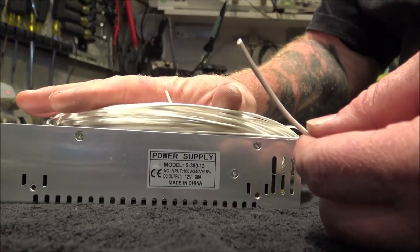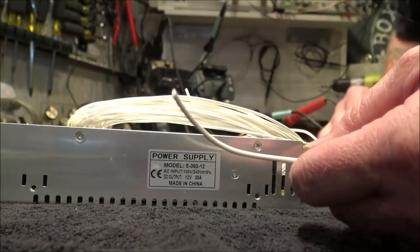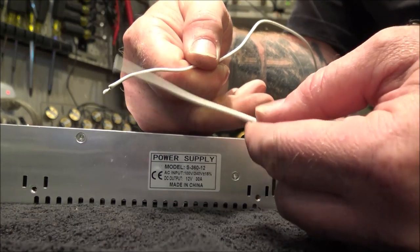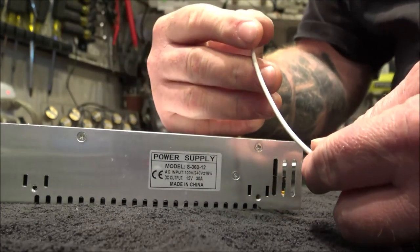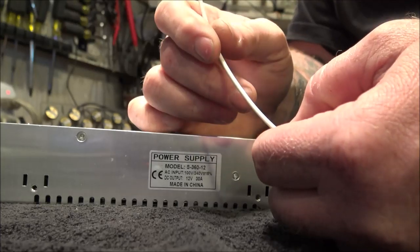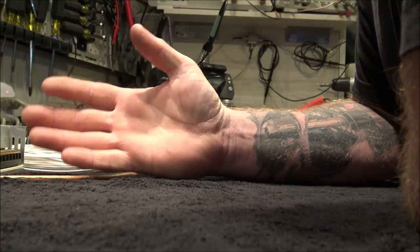This is copper nickel with a silver plate on it. This is silver plated steel. This wire here is magnetic. Nowhere in the description when you buy it off the internet does it say steel. It is about 15 cents cheaper per foot. That's why I was like, wow, somebody's listing this for sale. I bought a couple hundred feet of it, and we go to use it. This does all kinds of weird things when you put it inside of a transformer and try to pass RF through it because it's steel. It's magnetic. The moral of the story is cheaper doesn't always mean better.